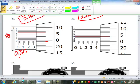Then this is between the 24 and the 25. Now it looks like we're closer to the 25, but we use the 24 because it's a vernier scale. So we always take the smaller of the two if we're between. So this adds up to 0.349. Then what lines up on the vernier scale is the 7. So what that's saying is that's actually 24.7 is where that's at. So 0.3497 inches. Now, of course, the nice thing on these examples is we have the pink line that tells you which one of the vernier lines lines up. The real micrometer, they don't just automatically turn pink on you.